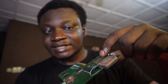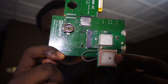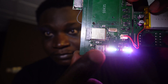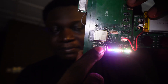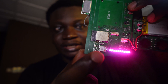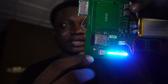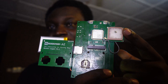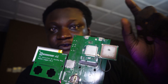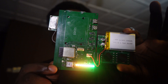So this is the GPS antenna. The A9G chip, which is a GSM chip, is also currently handling the GPS for this board. That's because the actual GPS chip I put on here — the antenna I got for it is not matched to this chip. Although I was able to communicate with it and get information from it, because the antenna is mismatched it was not able to get a lock on the satellite. So the A9G works and I can actually get pretty accurate positioning from it. This is very similar to what I did in the first version of the logger, the ESDK version. Everything that needs to work on this PCB works.